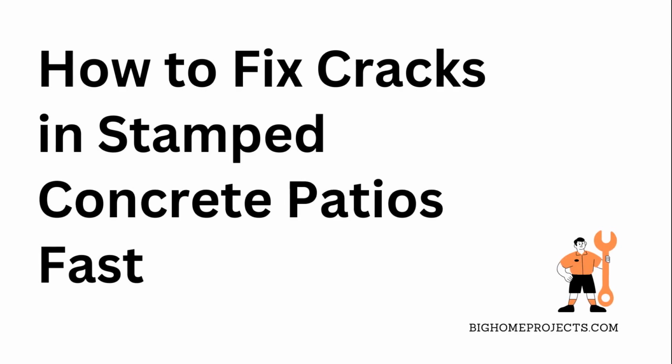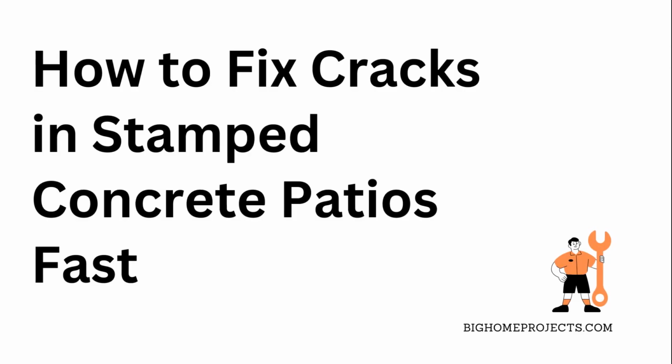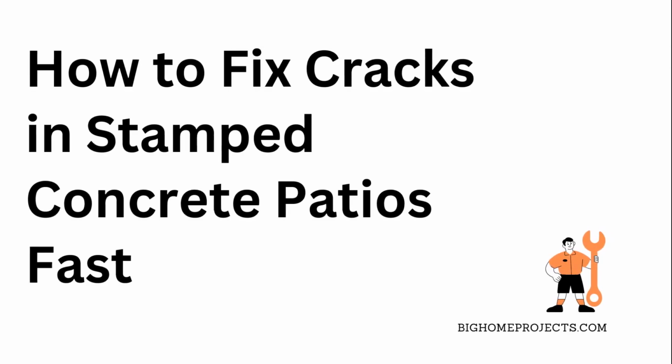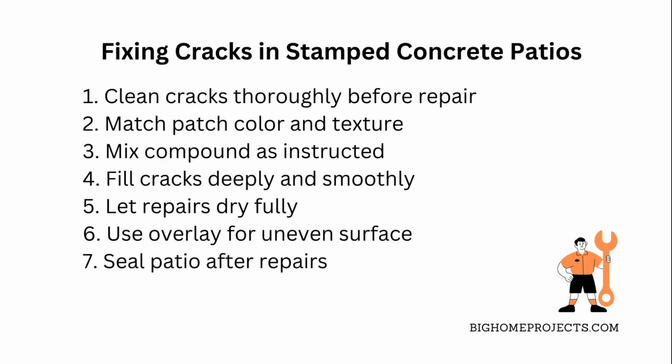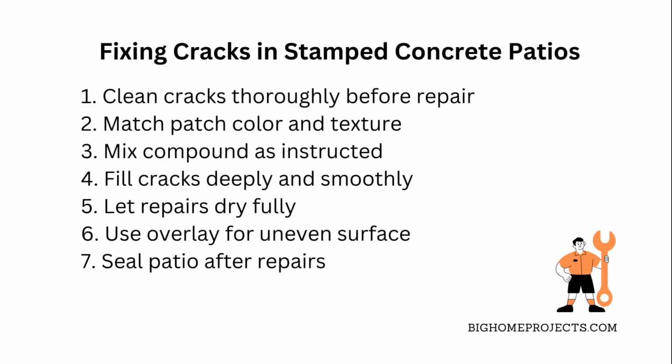Cracks forming in your stamped concrete patio can totally kill the vibe, but fixing them with overlay or patching compounds is way easier than you think. Okay, so first off, you gotta clean the cracked area really well. No dirt or loose bits, or the repair won't stick properly. Then, pick a patching compound that matches your patio's color and texture because you want it to blend in, not stand out like a sore thumb.